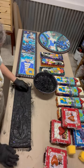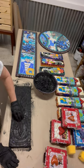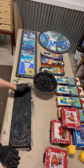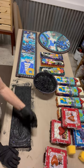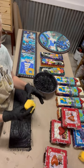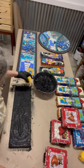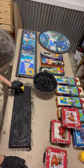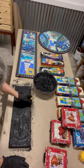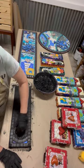Now what I'm doing is trying to remove as much excess grout with my fingertips as I can to alleviate having to wipe it off. Now these are grout sponges — they're very large and I slice them up because my hand is not that big and I want to be able to squeeze it in the water. But before I get it wet, it's okay to do a dry wipe at first. I'm just wiping to start removing, rotating the sponge and removing the excess grout.